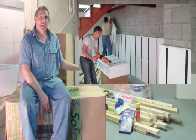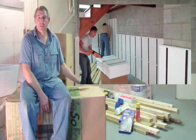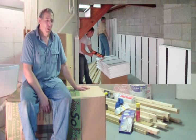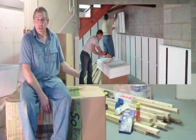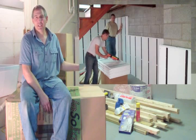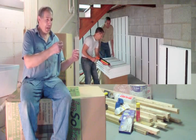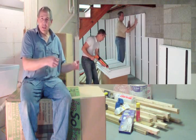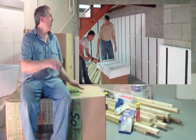After gathering all this lumber at the lumber yard and spending a little over two hours gathering it, packing it, sliding it into the vehicle, driving with it hanging out the end of the vehicle over to the site, unloading it, dragging it down the stairs, and stacking it up — only to have to pick this wood back up again, put it on the sawhorses, measure each piece and cut each piece, pull the wood after you cut it, crown it, lay it back down on the floor, lay out your plates, assemble it, and then try to tip the heavy wall section up into place and move it around the ductwork and around the red iron.